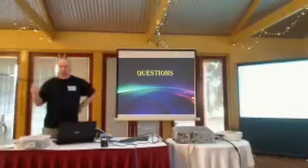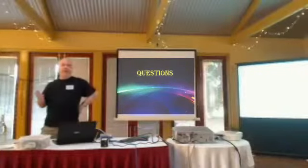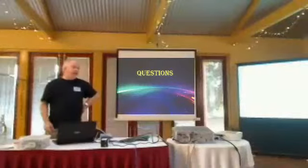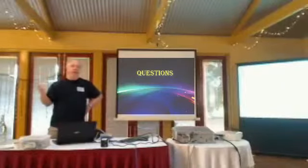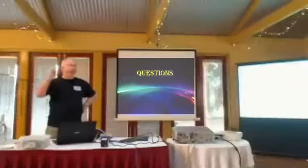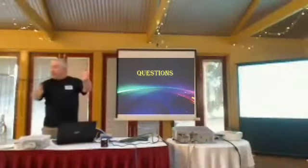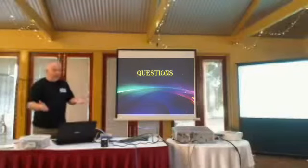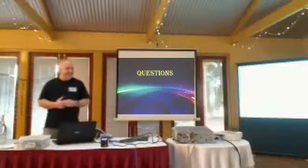To me, I've read, and I'm a member of most of the major forums out there, about more users saying, I send a packet out there and it gets dropped, and my light's going to do something. And it's so frustrating. Right? So you send the command out there to fade the lights and it never gets there, so they never fade. With DMX, that won't happen, because it's just going to keep sending those 40 frames per second. It might not start playing exactly where you tell it, but it's going to send the next 3 seconds of play. To me, that's the major advantage of running DMX over the other. That's the way I see it. Makes logical sense. Yeah.